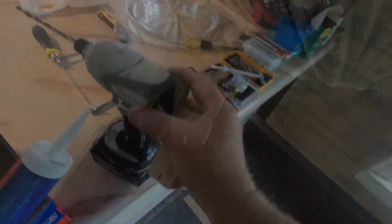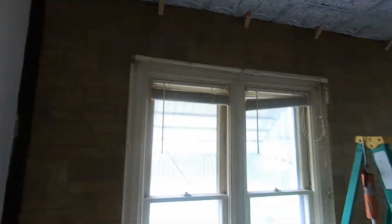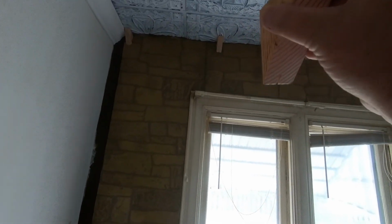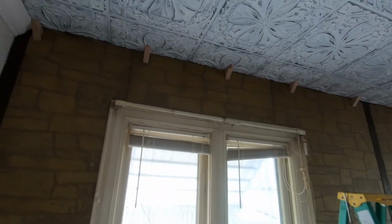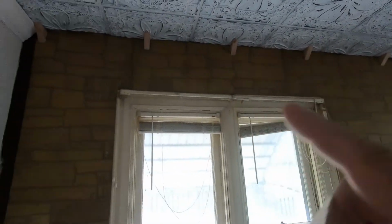That's good. And that's it, man. Set it and forget it. Pop a couple holes in, snot it up. Then snot this up, get it down in that kerf. Then a couple on each side. Push the thing into the wall, and then get it up so it just touches the ceiling tile. So it's not putting any pressure, it's just touching it. And then setting them and forgetting them, letting them dry. So these are ready to be shot up.